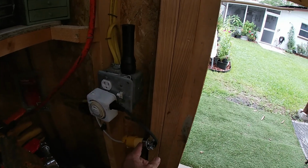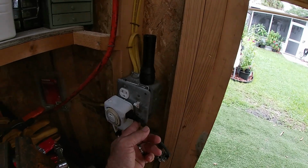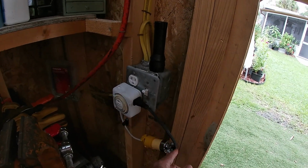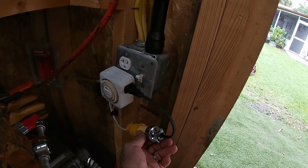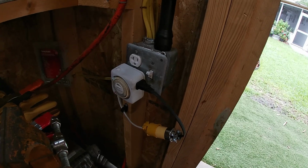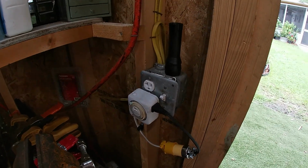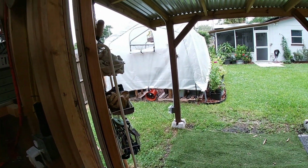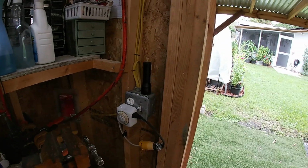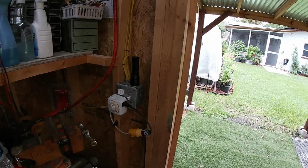And because these timers, I don't have a 3-prong timer, because these timers most of them come this way. They're like Christmas lights or whatever. I just made up a 2-prong cord into a female 3-prong receptacle plug, and that way the circuit, when it's used for plugging straight in there to bypass the timer, will have a ground. Back in the old days, there was no such thing as ground. They just used the earth in the pipe and everything. So that's one thing I did.